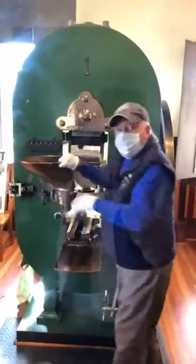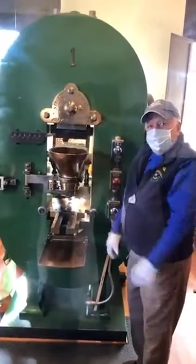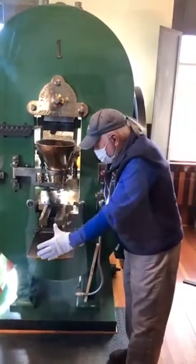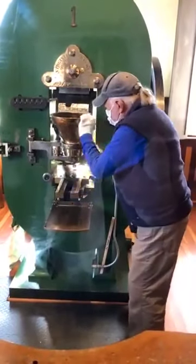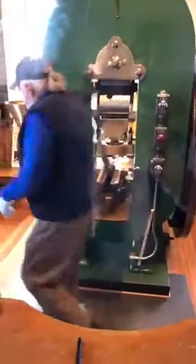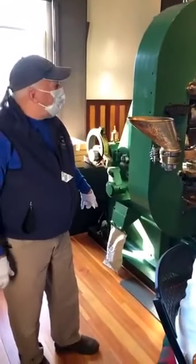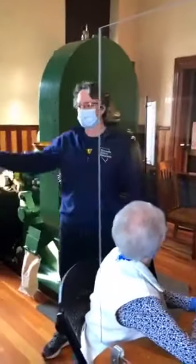In the hole, just the dime slot. This would be the loading tube. I mean, the loader. It had a drop tube right here, a piece of equipment we had to take off because it stuck out too far. It would shuttle the coins one at a time into the machine. The machine would strike them. The counter would keep count. The coin would slide down and end up in the back, on the floor. 1,000 coins, silver dollars, weighed 52 pounds.